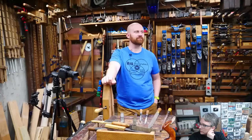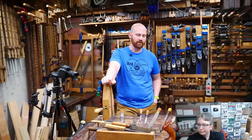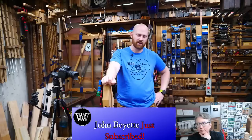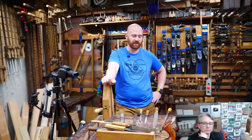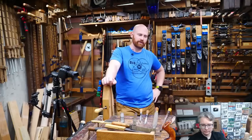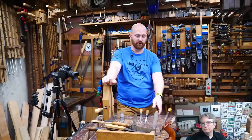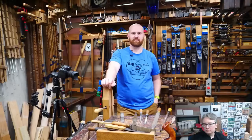Alan Lewis asks about pattern maker's wood rasps — very fine and half-round. Yes, it's basically a more detailed version of a cabinet maker's rasp. With files, rasps, rifflers, and floats, the names are the problem — every occupation has a different name, and the same file can have a half-dozen to two-dozen different names across different traditions and timelines. You'll hear cabinet makers, pattern makers, chair makers. The name means nothing — look at the shape and ask yourself if you have that shape. Don't worry about the names; the shape and grit of the tooth is what matters.